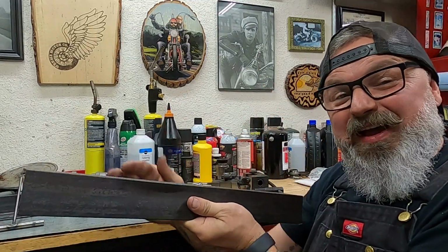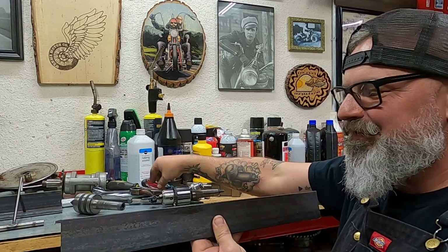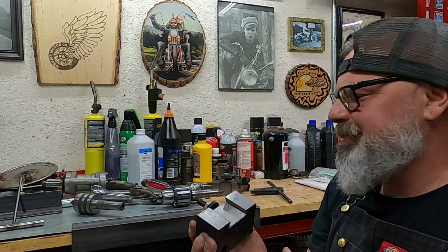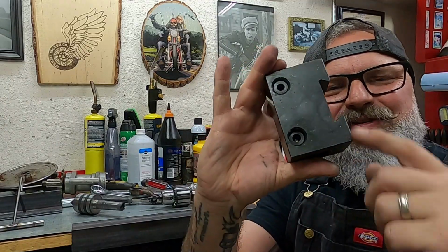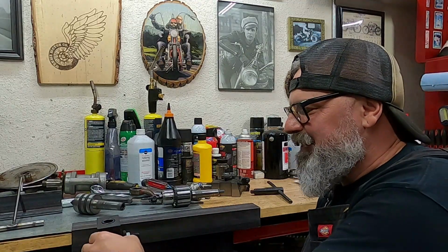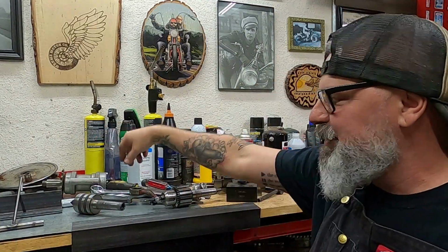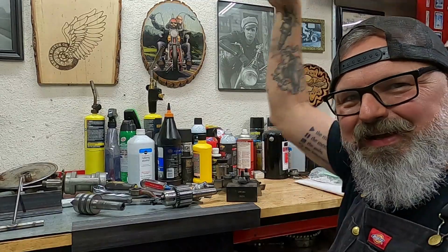Now, the stuff at the other end, things like files and my wrench to adjust my tool holder, all of that stuff I'm going to try to keep at that end. But the problem is that we have all of our tool posts, and you would almost want a shelf or something. So what I'm going to do is use these dovetails right here where they go into that quick release tool post, and I'm going to put little tabs right here facing out so that these will hang just like that all across the front, and that'll save us a little space at that end so we could put some holes there to put our files in, our screwdriver, and the last thing obviously is the chuck key.